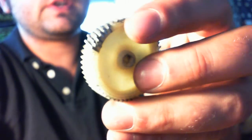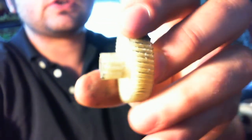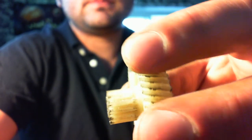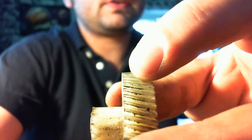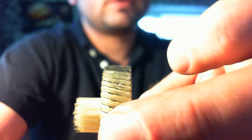And it got to where it was like that. Then what I did is I took a drill bit that fit perfectly in the diameter of this, and then I put it into a clamp and held the clamp up to a grinder. I zeroed in on the old teeth and kept spinning it until it ground all of them to the right dimension, as you can see.